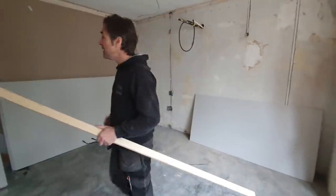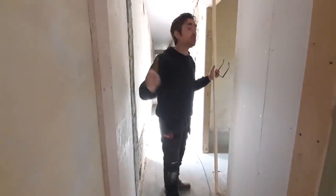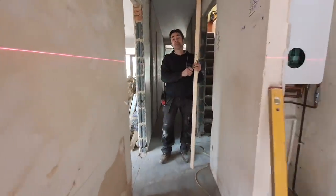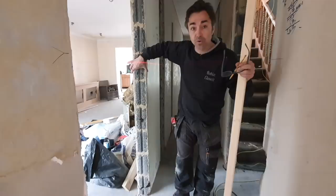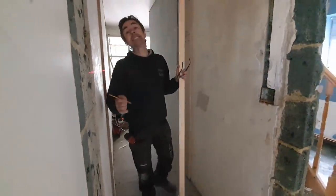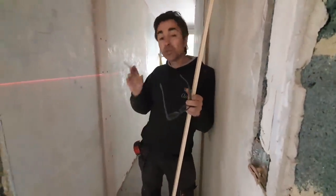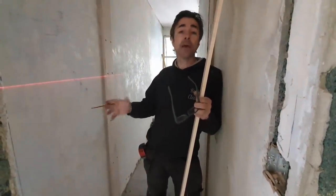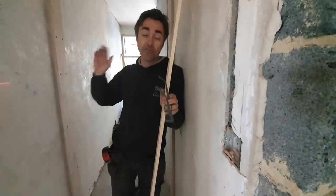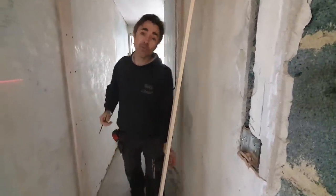We have a lovely long corridor full of doors in this building. We've got various apertures — some between two walls, new stud apertures, existing block apertures — and this creates a multitude of wall thicknesses. If you were going to buy standard door linings straight from the suppliers, the sort made out of whitewood or sometimes redwood, they come in two standard widths: generally four and a quarter inches and five and a quarter inches. None of our walls will suit that here.